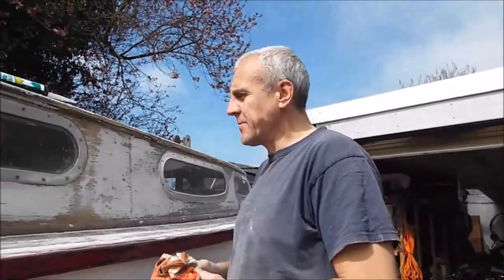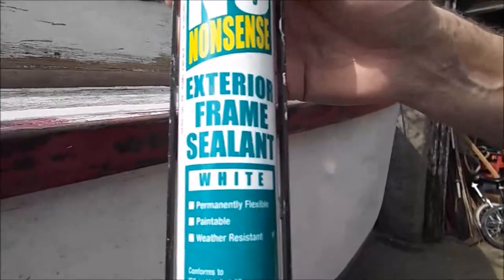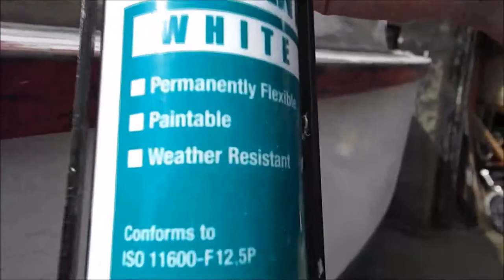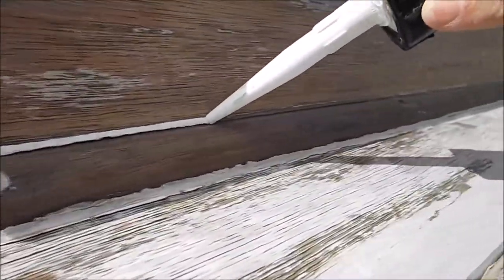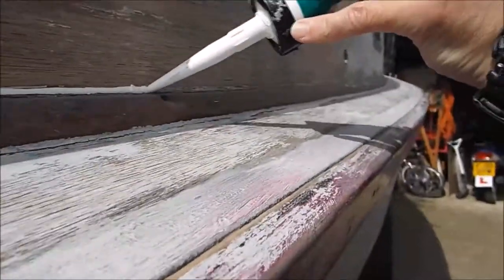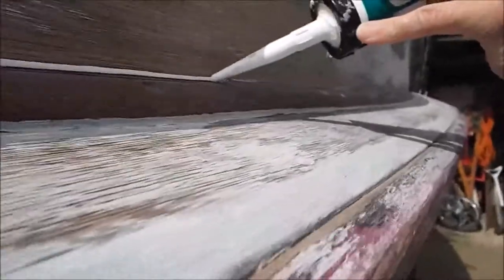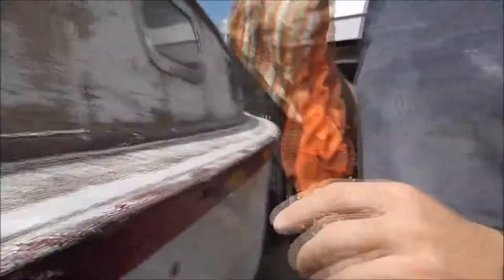So the next job is I need to put a bit of sealer on. You can see in these gaps here some of the sealant's come away all along these gaps. In the garage I've got some from Screwfix - No Nonsense exterior frame sealant in white, permanently flexible, paintable, weather resistant. What I'm going to do - just like you would in your house - is run a bead of frame sealant right down the frame here. I know the professionals do this all in one go but I'm just a bloke, so let's just stop there and then I'll show you what you do.